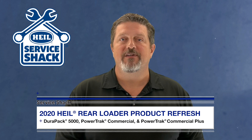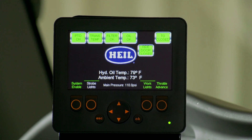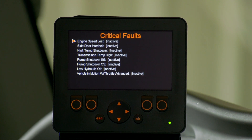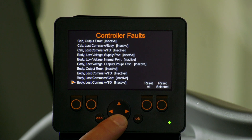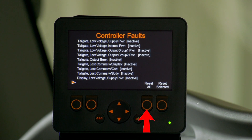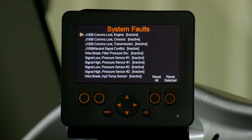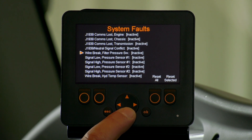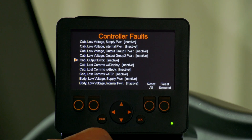Your HAL Insight display also has additional screens that allow you to check the current status of inputs, outputs, variables, faults, and a counter screen. From the home screen, pressing up on the arrow pad allows you to access the critical faults screen, which can be used to view the status of all critical faults. To reset a critical fault, you'll need to cycle the system enable on your home screen. From the critical faults screen, pressing right on the arrow pad accesses the controller faults screen, where you can view all controller faults and reset them using either the reset all button or reset selected button. Pressing left on the arrow pad from the critical faults screen accesses the system faults screen. To reset faults, push the reset all or reset selected button. To return to the home screen, simply press escape.